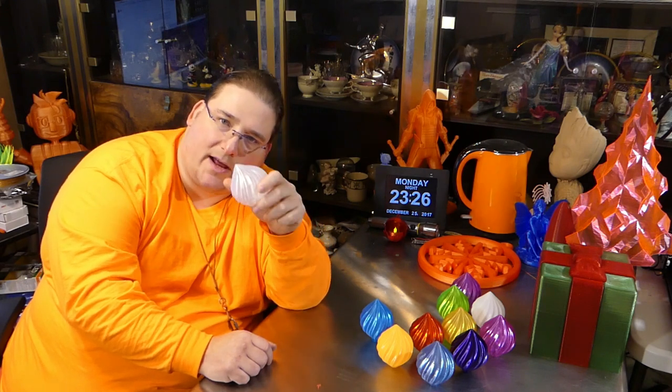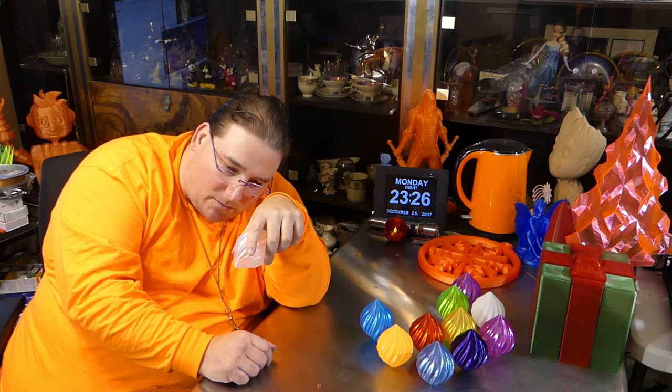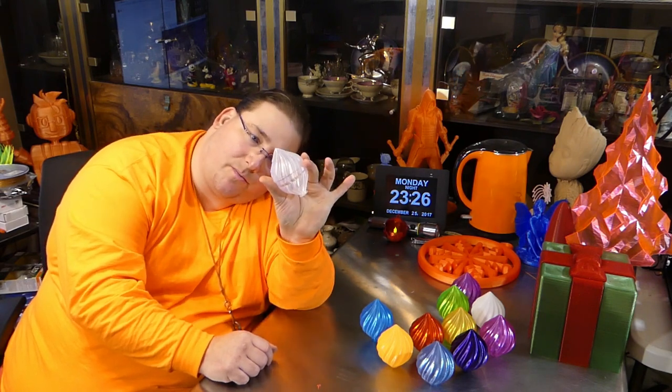You've got to print it a little hotter and ideally in an enclosure. Until then, slow down and print it hot. You need the new molten filament coming out to heat up and re-melt the previous layers so that the layers will bond properly.